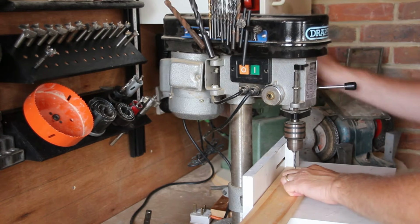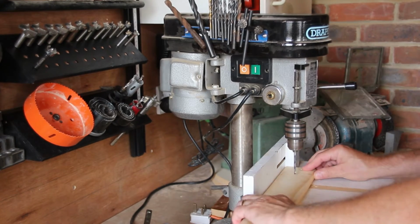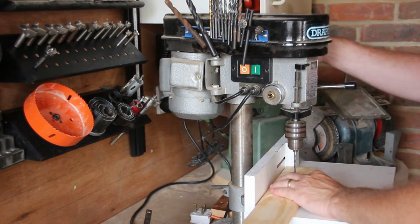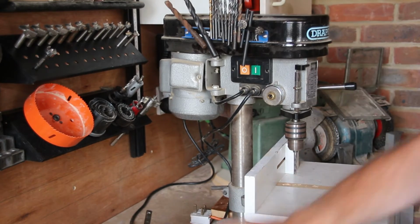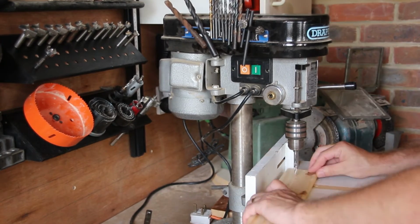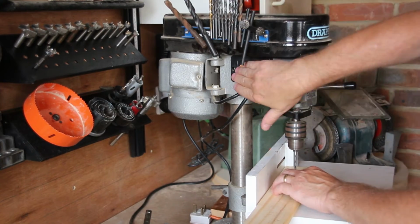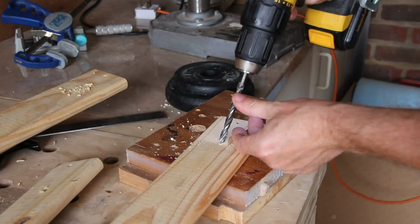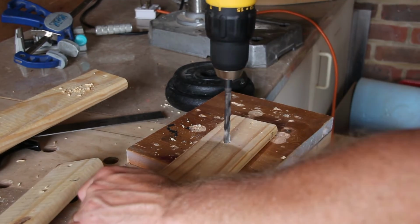I've adjusted my pillar drill table and the stop on the fence so that I can get a hole in exactly the same place on all the boards. This auxiliary table is so useful and it's really easy to make. I'll leave a link to a build video in the description. Having piloted all the holes, I followed up with a larger drill bit.